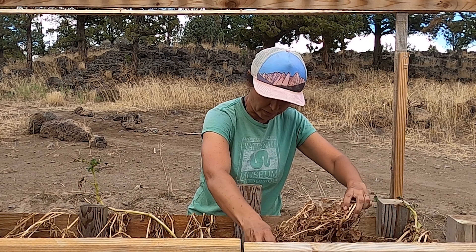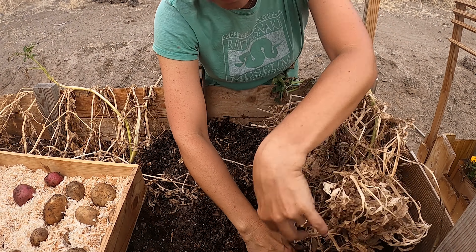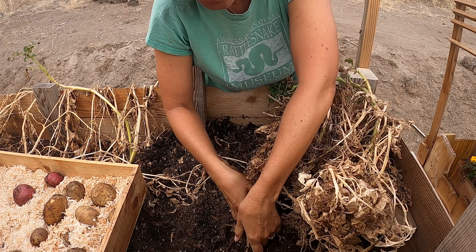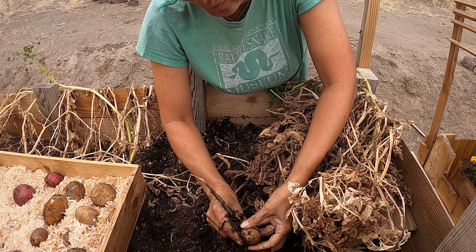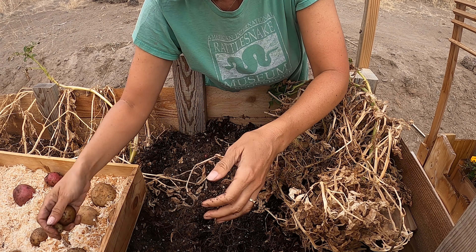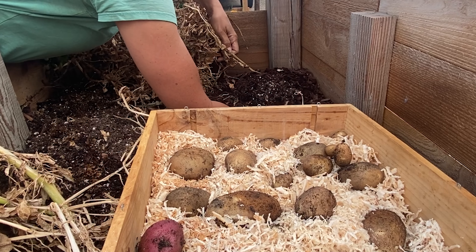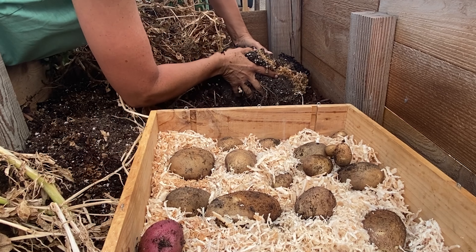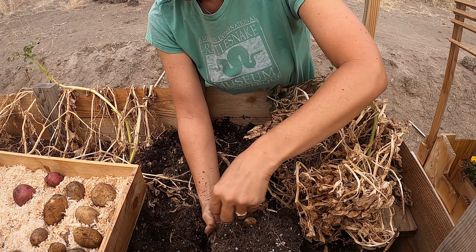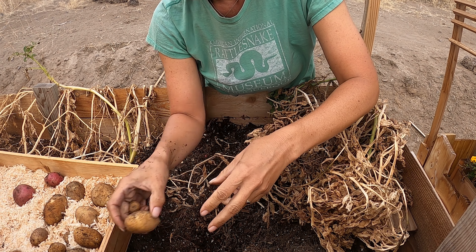I am going to be tracing the inside of this tape. The reason I have the tape set on the outside is because that is what I do not want to accidentally tear. When you put down painter's tape, it helps to prevent splitting on the surface, so hopefully that will give me a cleaner cut. Lesson learned already — I put the pilot hole back here, which in theory sounds great, but I'm right-handed, and to start here I have to use my left hand going this way, which will not work. I should have started here so I can just cut along. I'll figure this out.